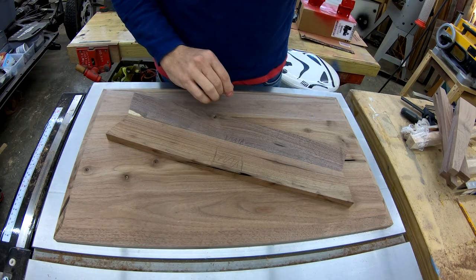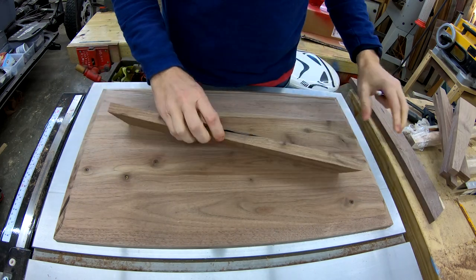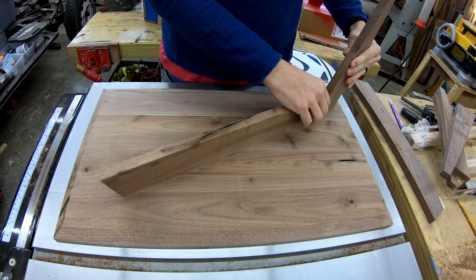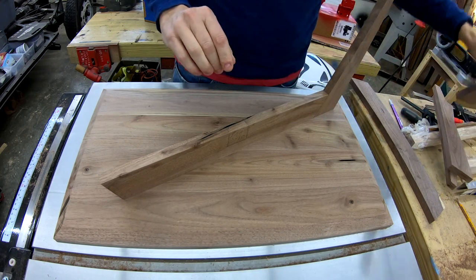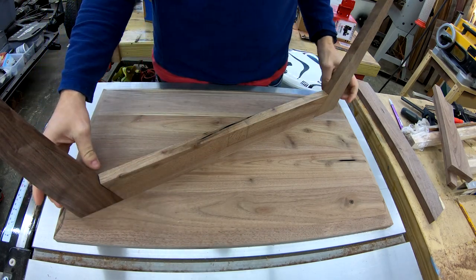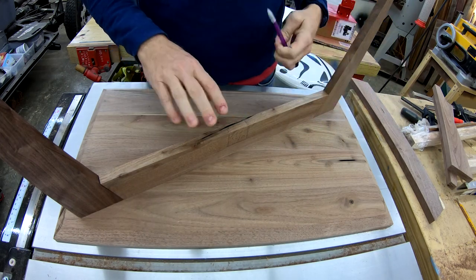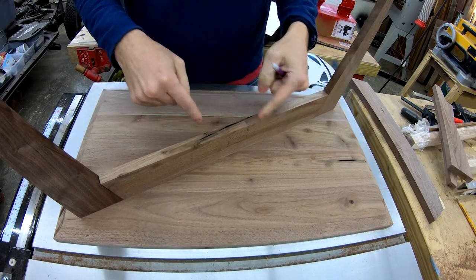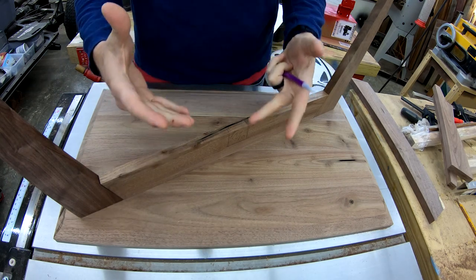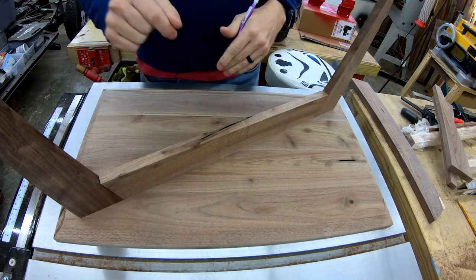So first I want to determine my angles, and I think all I'm going to do there is lay out my stretchers and get them spaced the way I would like them to be, and possibly use my legs to help me find that location. And then once I find the right location of the stretcher, I will strike a mark with the pencil where it's located, and then I'll do the same thing for the opposite one, and then I will measure the angles that are made by the pencil marks. The next point would be determining the depth of the half laps. And so let me do this part first, and then I'll get to the next part.